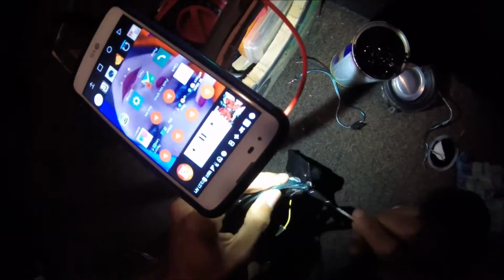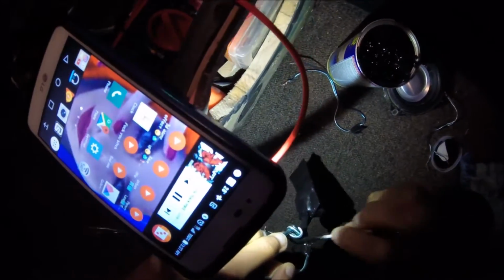the water pressure is. And if you think about it, the wires are acting like a straw, so even though there's copper wires in the tubing, there's still little tiny air gaps that the water can seep down. So all you have to do is just E6000 the ends of the wire.